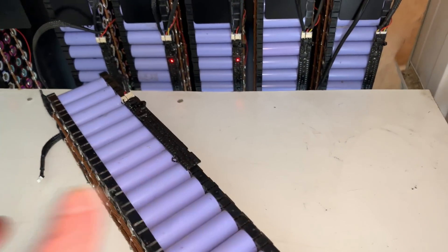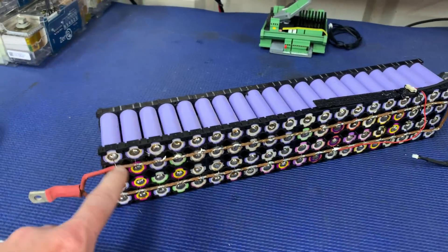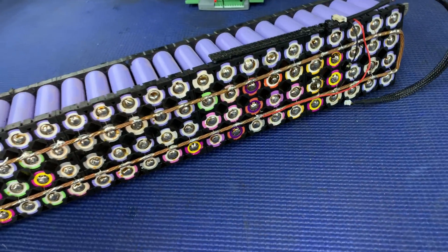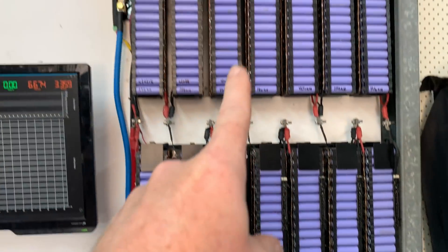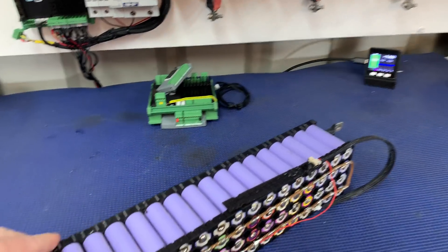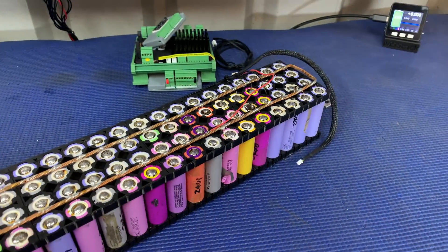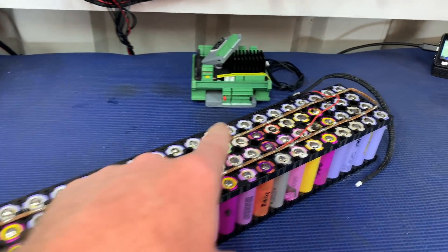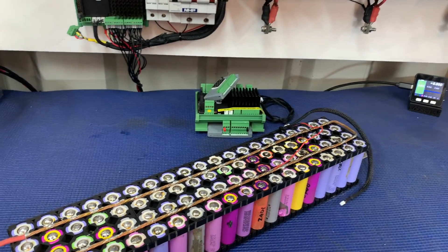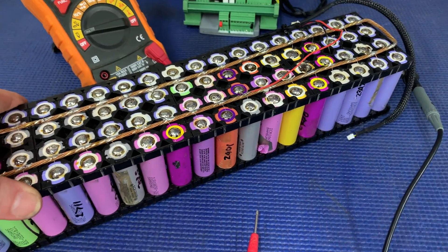I did think it was the older style bus bar, but it is actually the newer style, which means I can just pull a cell from here and swap it over rather than make another one. But first, let's try and work out why this failed. The first thing I do is grab the multimeter and test voltages on every single cell — that will quickly tell us if there are any disconnected fuses. A quick voltage test didn't bring up any problems.